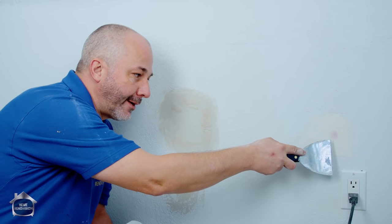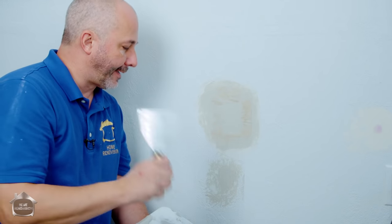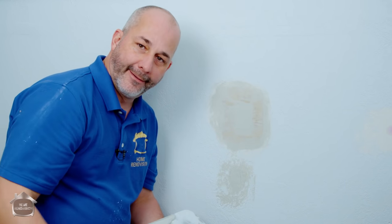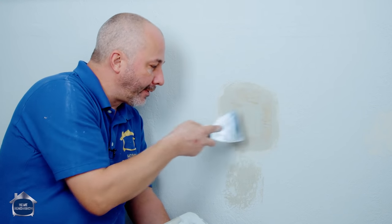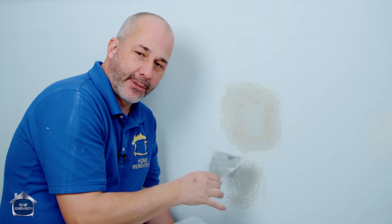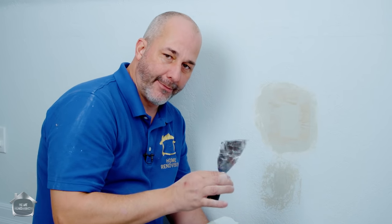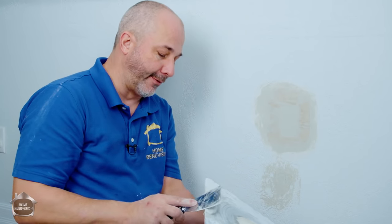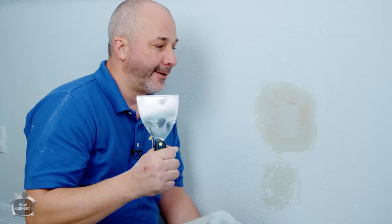The other patch - you can see the pink in the middle, it's still not dry, so we're going to wait. The last application we'll use Drydex on all three patches. It doesn't take much, just a last little bit to get rid of all the ridges. We want to have a smooth surface before adding texture. I know texture is used to hide imperfections, but when you're patching you really want to keep everything as perfect as you can before you add it.